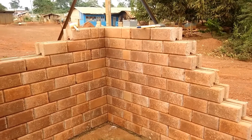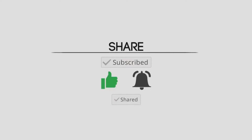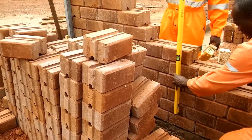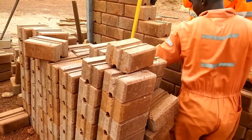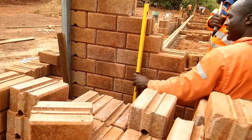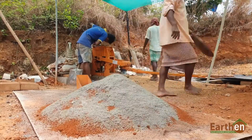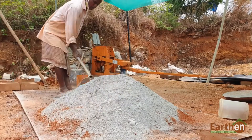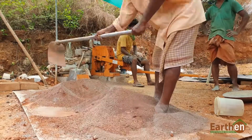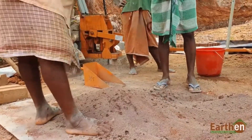Interlocking bricks are an improved form of traditional clay bricks. Each brick is designed to seal itself to surrounding bricks without the use of mortar. Automatic locking is achieved using a shear key and lock mechanism. Depending on the design, the shape of the shear key will vary and provide a complementary lock on the opposite side. Load transfer is achieved by shear transfer and gravity. Interlock bricks come in different sizes and locking systems depending on the supplier.